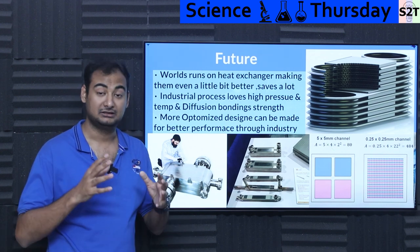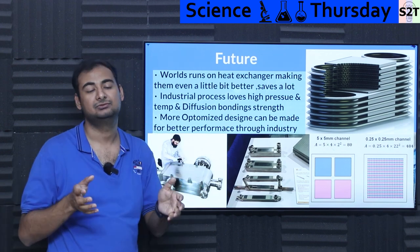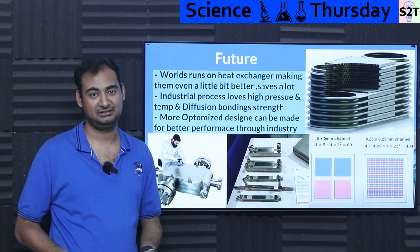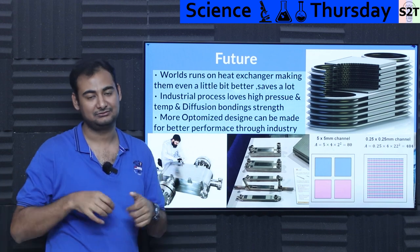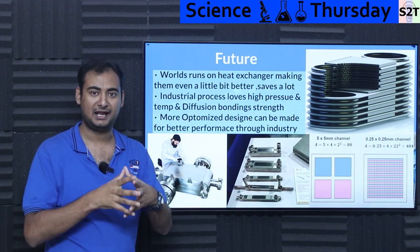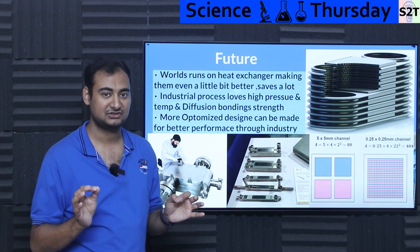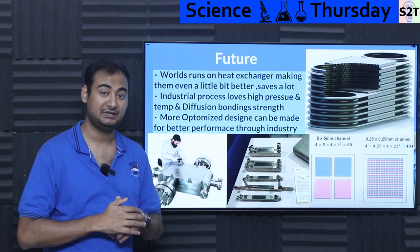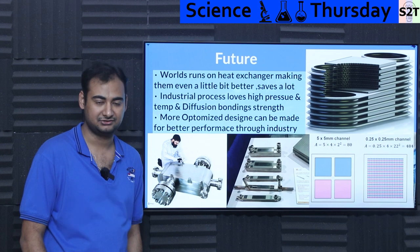Even with injection molding, the mold requires cooling. But how do you cool giant hardened mold material with very low thermal conductivity? You need micro channels in it, but you can't drill them conventionally. What manufacturers do is build the mold layer by layer with microfluid channels etched in, diffusion bond it, then send it to a CNC machine for final shaping. Water ends up literally one or two millimeters away from the plastic, removing heat very efficiently. The plastic gets excellent crystallization structure, the mold lasts much longer, and you don't need giant radiators. This technology is slowly revolutionizing day-to-day life, almost like ceramic bearings.